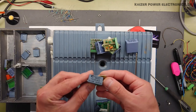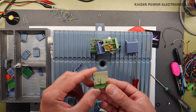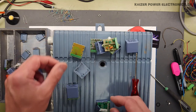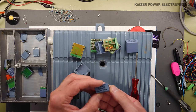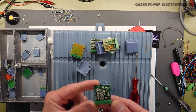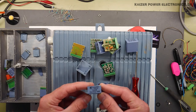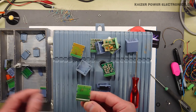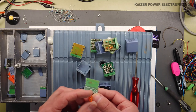There's an equalizer at 9 dB, 862 MHz — essentially half an inductor and a smaller inductor with some passives at the back. We also have a reverse equalizer at 65 MHz, not much on the back side but chock full of resistors, inductors, and capacitors on the inside. And finally we have an output equalizer at 0 dB, which is just an empty PCB — as we've also seen in another teardown, all these 0 dB attenuators are just a bridge on the inside.